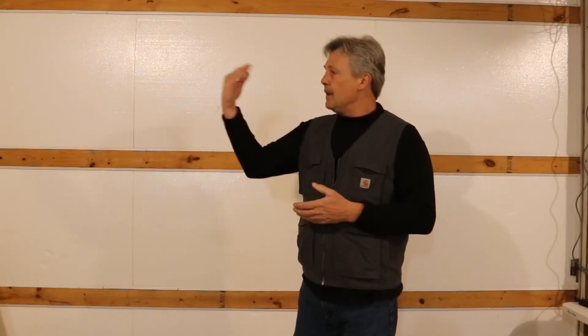I do have a video called 'An Easy Way to Insulate a Pole Barn' and I'm going to leave that in the description so you can go back and see how we actually finished the interior of our building. This is 20 years old now and we haven't had any problem with it. In that video's comments I pinned that we finished and insulated both ceiling and walls at today's prices for just under $3,000 — and this building is 30 by 50 with 9-foot ceilings. We have an R-factor of about R-19 or even a little higher, with 8 inches of insulation in the ceiling and 6 to 8 inches in the walls.